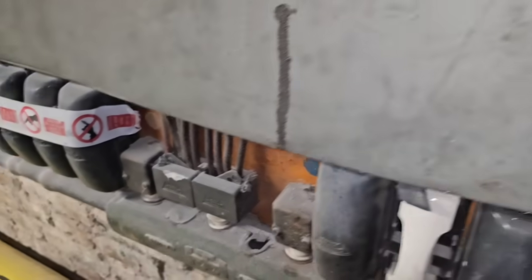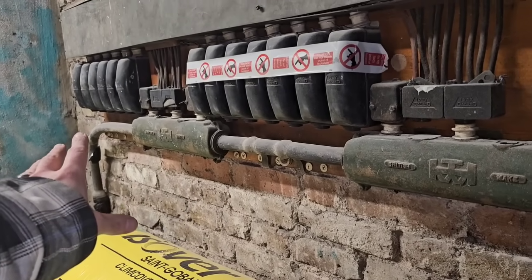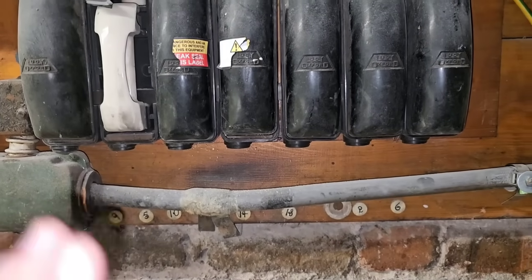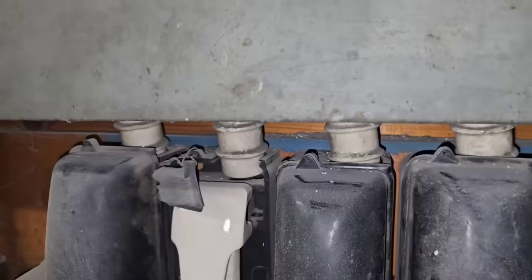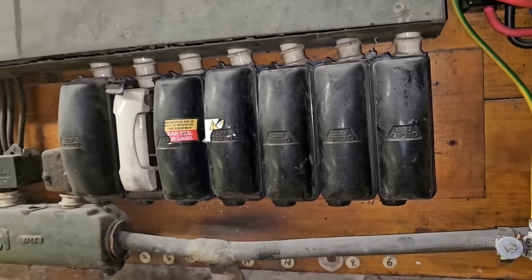There's a lot of back-and-forth about who owns what. The BNO — the building network operator — owns anything after these fuses, so they need to upgrade all of these cables. It also becomes a nightmare for meter identification; the meters are in the flats and there are old labels at the bottom to identify the flats, but they don't always marry up. You can get fuse tracers that put a signal down the cable so you can find the right one, but it's an absolute mare.